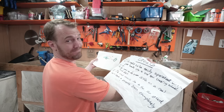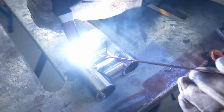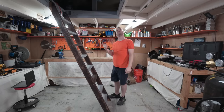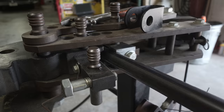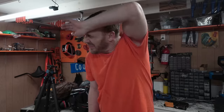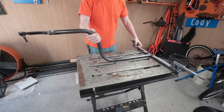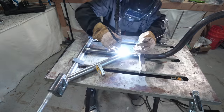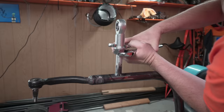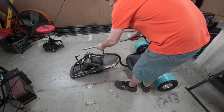With a firm understanding of what needed to be done, it was time to get drifty. I'm gonna raise the axle, lowering the trike's center of gravity, allowing me to slide. Now I needed to use the tube bender to bend the frame into shape. Knowing that this part of the trike would experience the most stress, I needed it to be as strong as possible, so I bent the tube instead of cutting and welding it. Time felt like it was moving faster than normal, and I didn't want to be late for my shift. With the most complicated parts of the build completed, it was just a matter of attaching additional bracing, the connecting joint for the steering column, the steering shaft to the steering wheel, swivel bearing, seat, and wheels. I secured the one-wheel inside the frame, hopped on, and baby, you got a drift trike going.